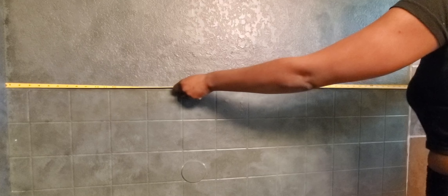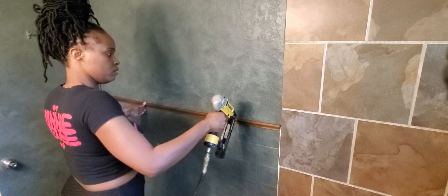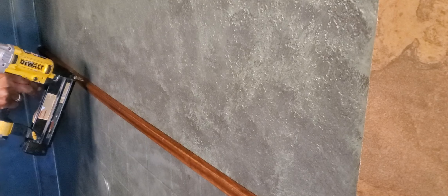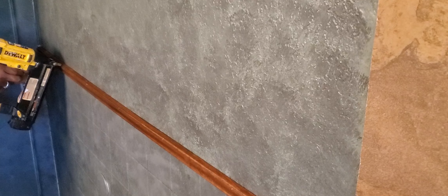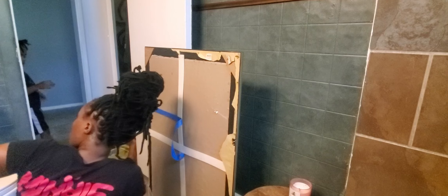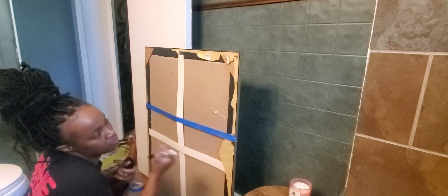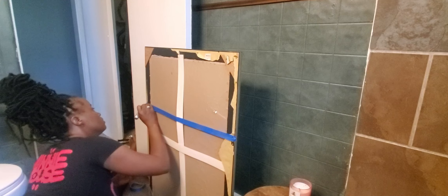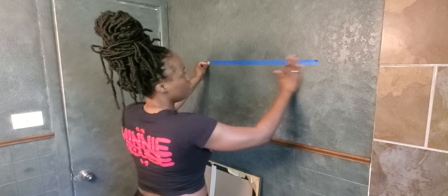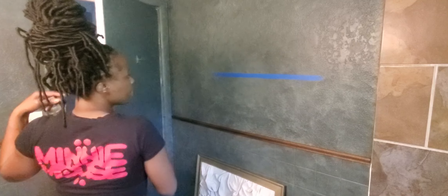The transitions between the drywall and the faux panels always seemed a bit unfinished to me, so I cut and stained a piece of trim that matched the shelf and installed it. After a while though it seemed a bit too busy, so I ended up painting it the same color as the walls — that made a more seamless transition, and you'll see that in the final. To get perfect picture placement I use painter's tape on the back of pictures to mark off where the wall hooks are, then using a permanent marker I mark the spaces, remove the tape, and place it on the wall where I'd like the picture to hang. I also use a level to make sure the holes are nice and level, which minimizes making unnecessary holes in the wall.